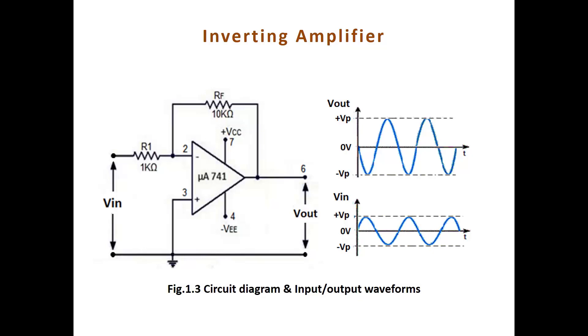This is a circuit diagram of an inverting amplifier with its input and output waveforms. In this circuit, input is applied to pin number 2 through a resistor R1, and a resistor RF — the feedback resistor — is connected between pin number 2 and pin number 6. Pin number 3, the non-inverting pin, is directly connected to ground. Supply pins are pin number 7 and pin number 4. Output signal is observed with an oscilloscope.